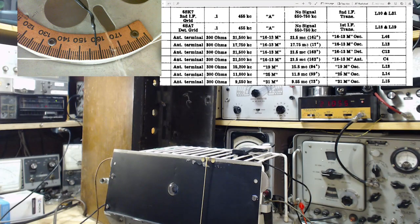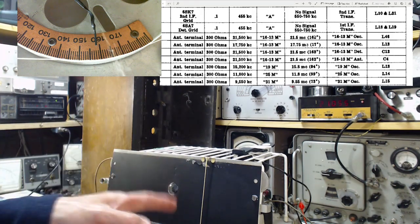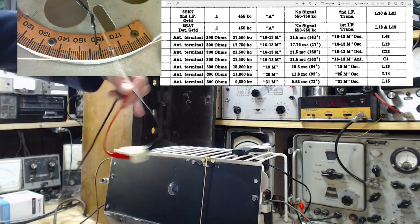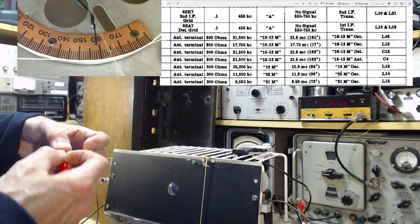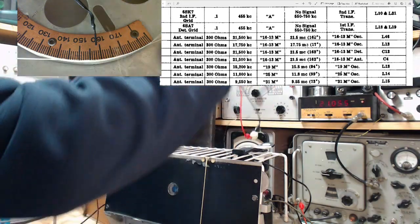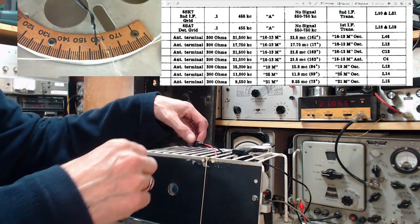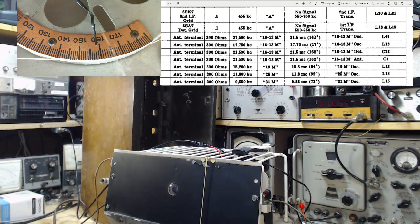It wasn't going well, and I packed it in and went outside to be in the sun. And I'm right at the it's not going well point. I think what I need to do is really determine where the local oscillator actually is on this radio. So the way I'm going to do that is with the SDR. And I'm going to use this, the SDR antenna lead here. Pretend this is a pickup coil. And I'm going to put this somewhere back here in hopes of it picking up some of that local oscillator signal. Try it like that.